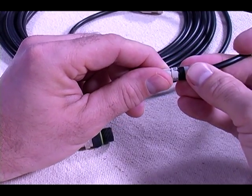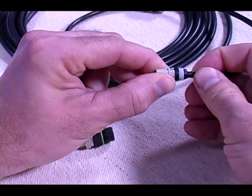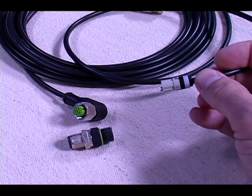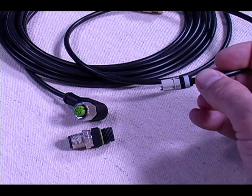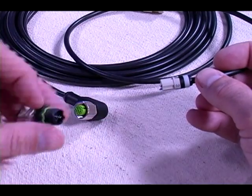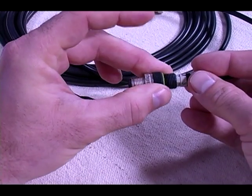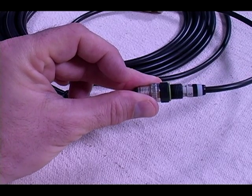Now if you can see, the coated insert does have a marked pinout on it as well. Each wire hole is labeled 1, 3, and 4, and if you look closely at each number, it's color coded. Number 1 is printed in brown, number 3 is printed in blue, and number 4 is printed in black. Easy enough, right? I still suggest hanging on to the cable printout on the bag.